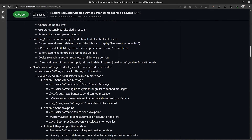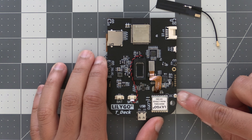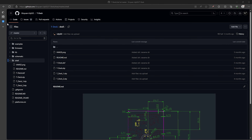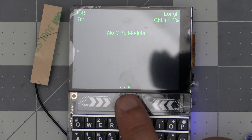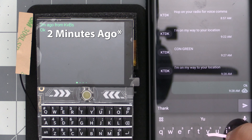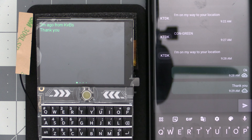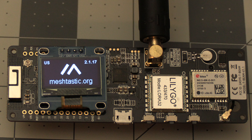There are also a few things that need to be pointed out for the T-Deck itself. This device is just a board with components and a keyboard - there's no case for it, so you'll have to print a case with a 3D printer if you have access to one, and there are already a number of files available for it. Another thing to note is the device does not have a GPS in it, so with no GPS the device is unable to know the current time. When you receive a message it will show the incorrect time it was received - in my case it was saying two days ago even though I just sent a message to it. The fix for this is to have a MeshTastic device on the network that does have a GPS, like a T-Beam or a WisBlock with a GPS module. These devices will be able to provide time to devices on the network that have no GPS.